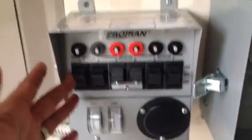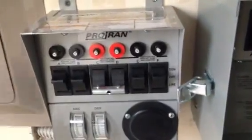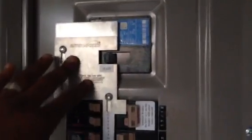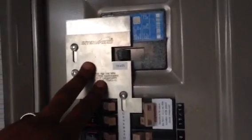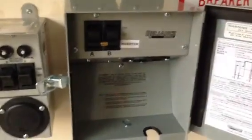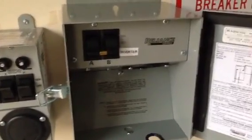With that in mind, if you're going to back feed into your home, get a transfer switch so you can protect others as well as yourself. A transfer switch like this will allow you to energize certain critical circuits in your home. Also get an interlock kit — it was really simple to install, I had an electrician do it — and this will allow you to safely and legally back feed all of your circuits. Just a little update video with emphasis on safety and making your system safer for yourself and everybody else. Take care, YouTube.